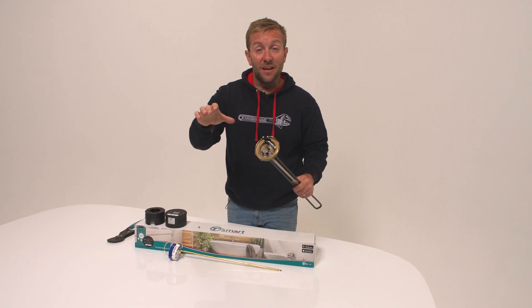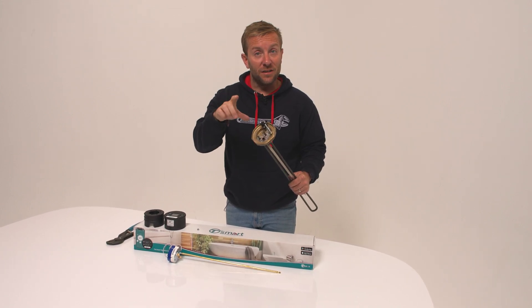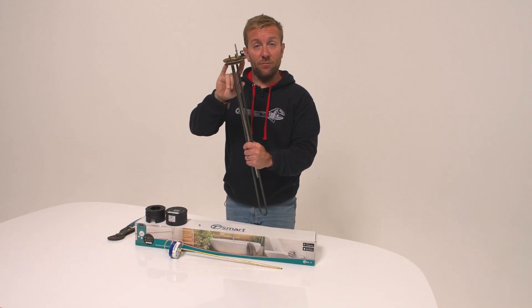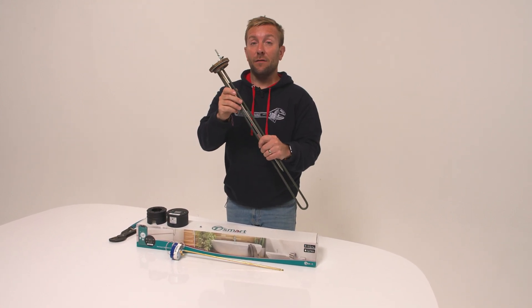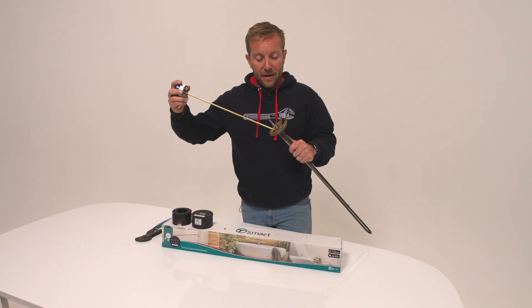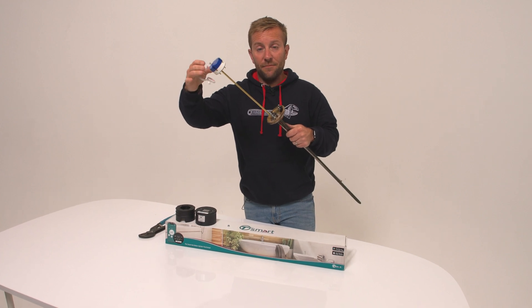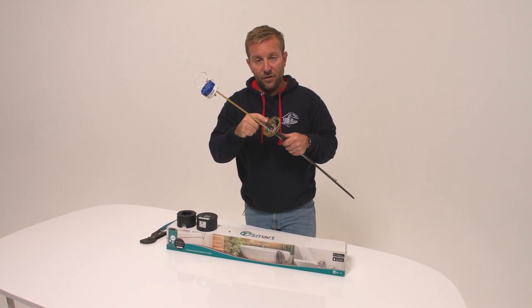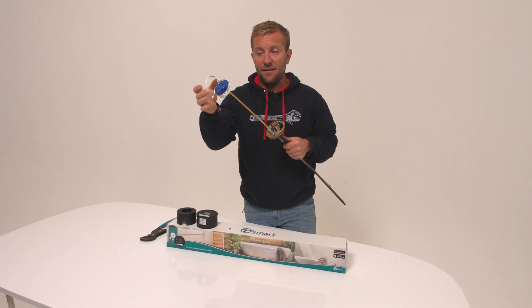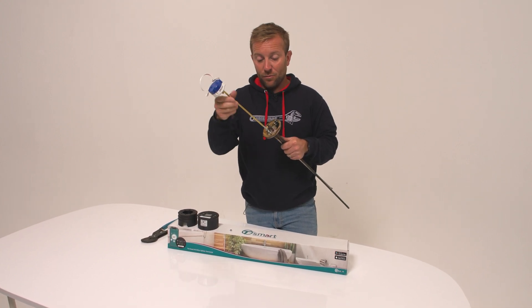As you guys know, unvented cylinders can have slightly smaller size flanges, which brings me to the point on this — we've got a two and a quarter inch flange on this one here, which is the standard size you're going to find on most vented cylinders. So very simple — we could just pop this back in here. And if you were just going to update your one, if it has these tongs on here like that, and this particular kind of shape of thermostat on the end, you're going to be able to use that with one of these T-Smarts.